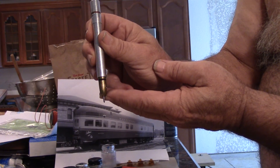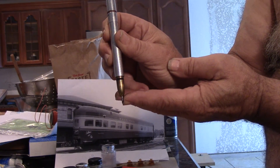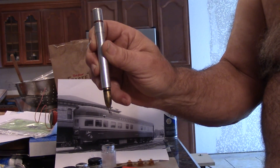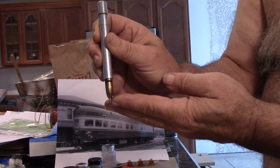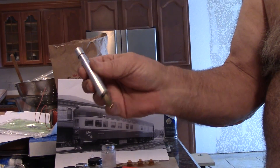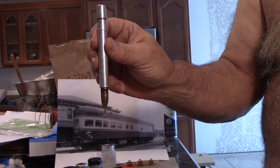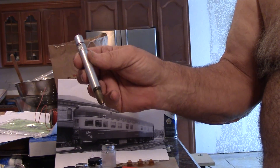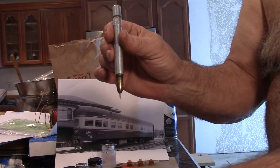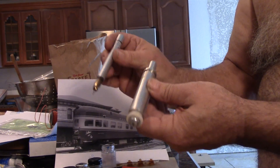Then you bring your quill down and load it — bring it down about an eighth of an inch. This spring compensates if you're putting your paper on wood or, preferably, sheet metal so it's smooth. If there's a little bit of waviness, the spring takes it up and the tool will still draw the picture. So you can turn a CNC mill into a plotter, of course limited by your X and Y axis movement. I've used both of these tools and they work just as intended.